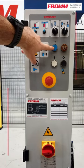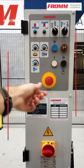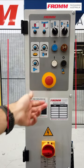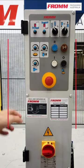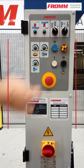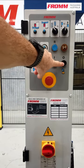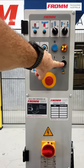You've got your alarm acknowledge, start and stop. Every time an emergency stop has been pushed, we twist it to disengage and use the R button to acknowledge. If you need to return the machine to home, you hold down the stop button until the machine returns to the home position.